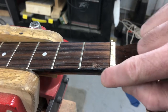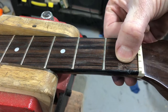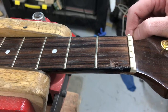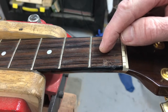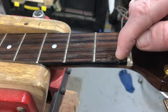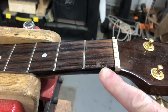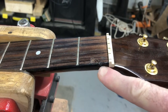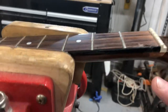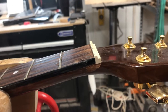What the client wants is to get the guitar back going as soon as possible. So what I'm going to do is use some epoxy with a rosewood sawdust powder to fill this in, then take some aniline dyes and try to mimic the grain pattern. We'll smooth it out, use some black epoxy to fill any voids, and then touch up the finish in the standard way.